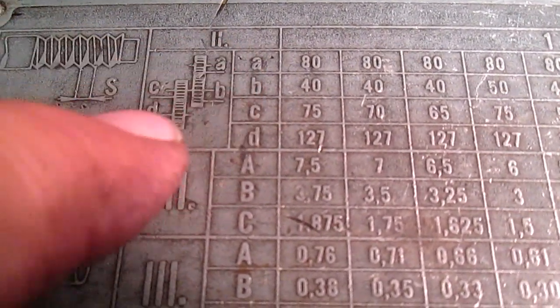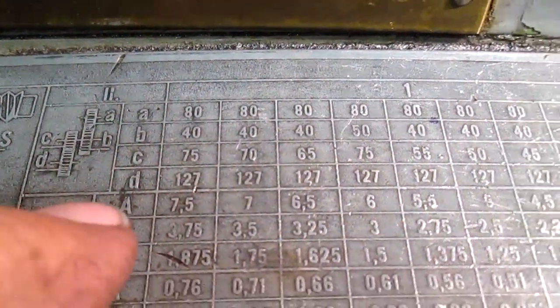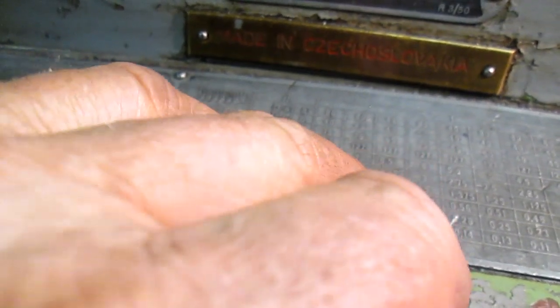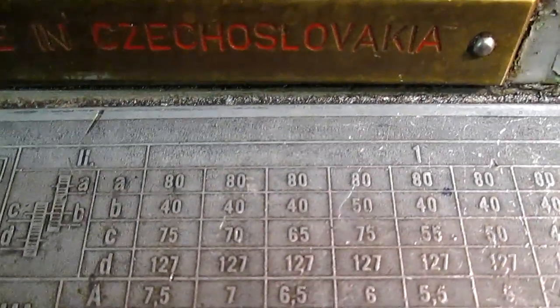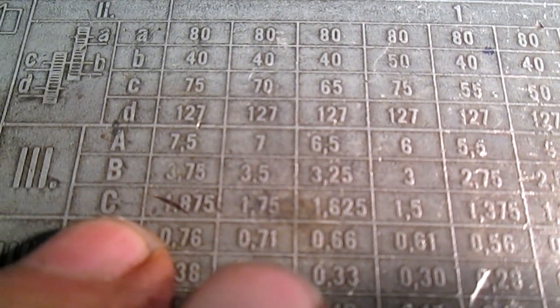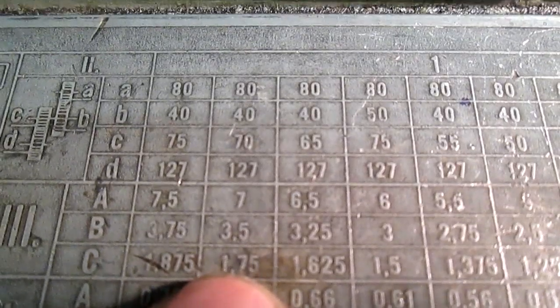Your final setup is the gears A, B, C, and D, and they correspond — we're going to 1.75, which is what I wanted. There's 1.75, so it says put number three in the C position. Number one bypasses the entire transmission. So number one and number C, and then everything else gets done with gears. So we're at 1.75, which is here.